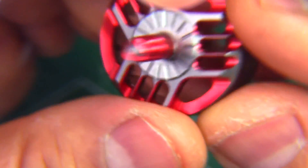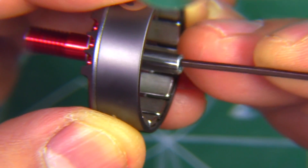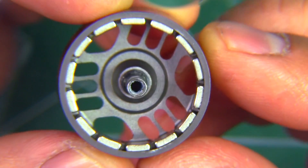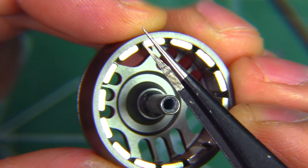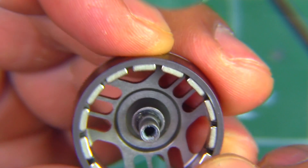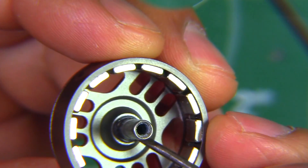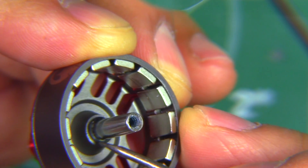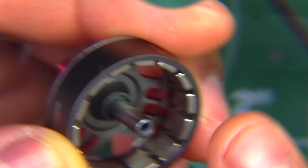Here's a close-up of the bell. There's the 4mm shaft — it is not hollow; it's only hollow where the thread is, so it's solid all the way through. Those are arc magnets. The bell ring has a little lip there that's going to help keep the magnets in place — pretty chunky magnets with good density. There's also some kind of rubber washer which, according to the literature on the motor, is there to help dampen vibrations.